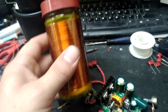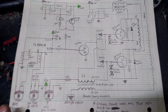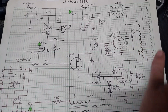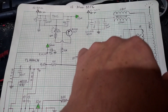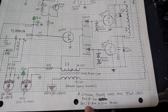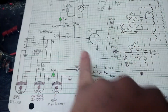I tried winding this for it — didn't quite work out. I could get decent output from much larger coils, however. I ended up drawing the completed circuit. Basically the same deal, except I've got the specs here: 100 nanofarad on the drains, zeners on the gates, and I've got 60 microhenry chokes. These are the specs of the primary and secondary, and I've included the interrupter I'm using, the TL494.